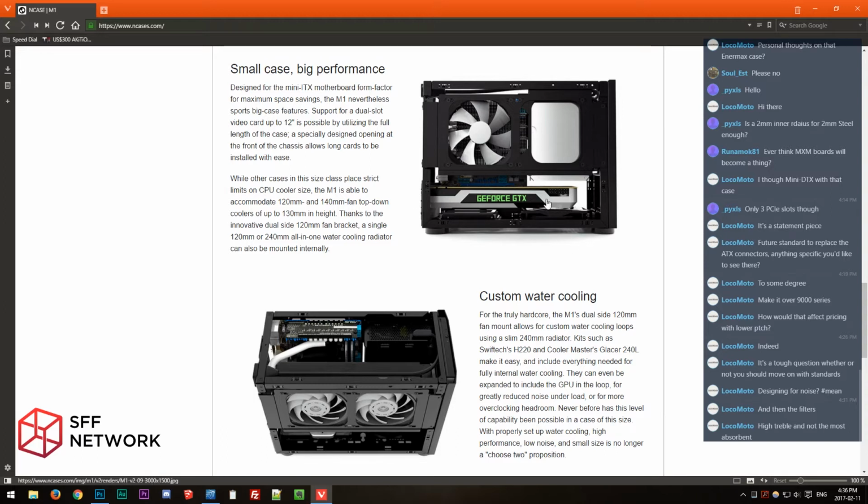And same thing with the video card. I think at one point I had an R7 260X, I believe, because I started with the 5750. I took the stock fan and shroud off of it, and then I put an actual 120 millimeter fan beneath it, mounted to the vent on the bottom. So same thing: there's the intake vent, the fan's right there, and the heatsink's right there. The fan didn't have to work that hard to pull air in because the vent's right there.